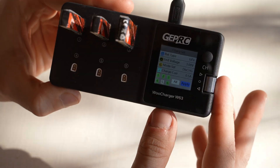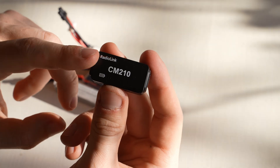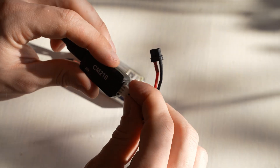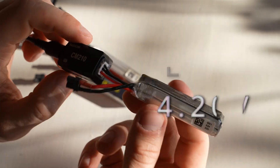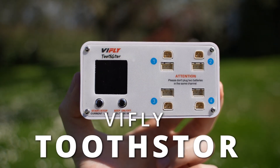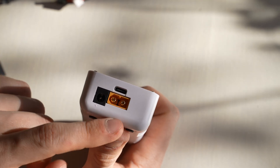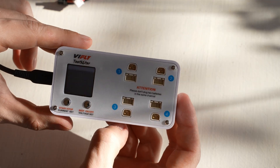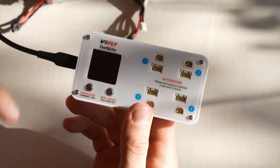Now let's talk about 2S chargers. I have the smallest tiniest 2S charger ever — this is from Radiolink. I feel like it's made for charging radio batteries, but you can still charge LiPos with it. You just plug in the USB on one side and the LiPo on the other and it starts charging. It does not charge high voltage batteries — it charges to regular 4.20 volts. If you want to get serious about USB-C 2S charging, this is the VFLY 2S charger. It supports a quite wide variety of inputs: a barrel plug, a regular LiPo battery, or again a USB-C connector. The maximum input power is 65 watts, so you can totally use your power banks with it today.